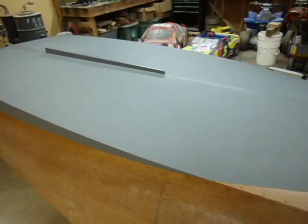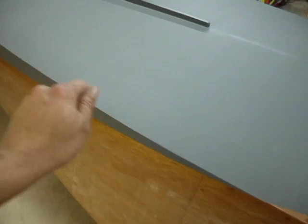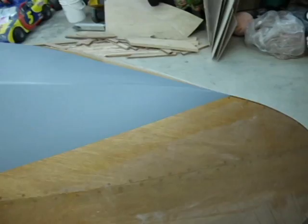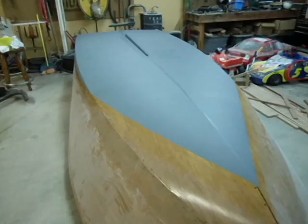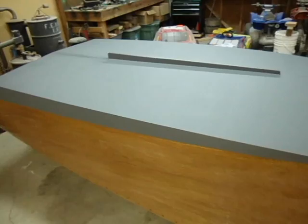Let it cure a few more days, tape off and sand again, two coats of white, tape off our three-quarter-inch white stripe, paint everything flag blue two to three coats, then peel off that tape to reveal the stripe — and bottom paint is done, hull is done, time to flip it. We are making fantastic progress, things are turning out beautiful, I couldn't be more proud. Thanks for watching — please rate and comment, subscribe to the channel, and we'll see you on the next update of building the Zip.